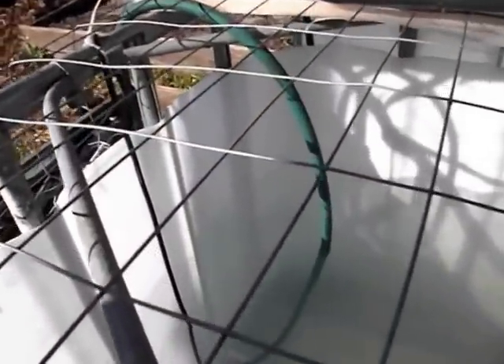The system is driven by this pump here — I think it's a 620-gallon-per-hour pump; I bought it from Harbor Freight. It should pump all the water more than one time per hour, because I do have probably about a four or five foot head.